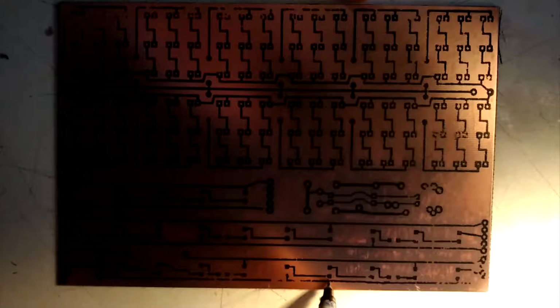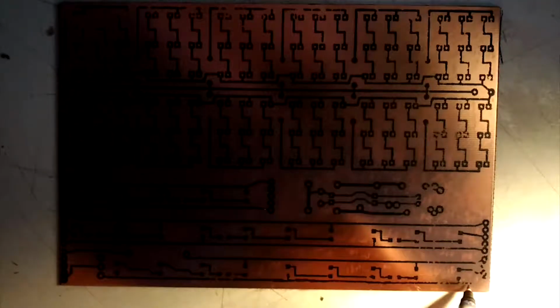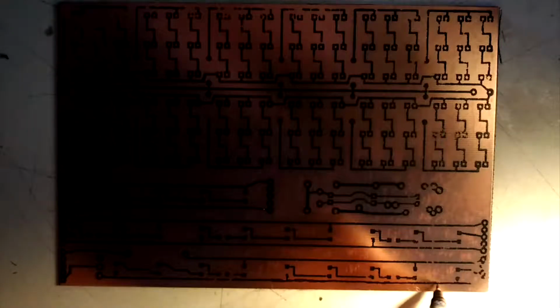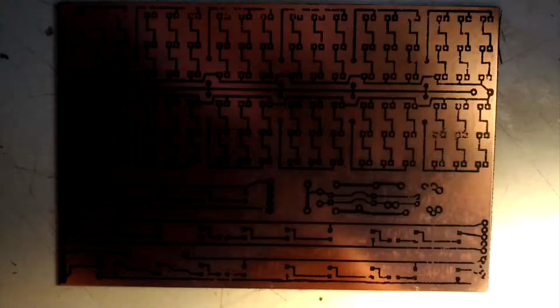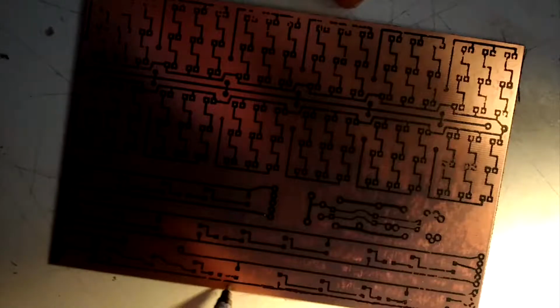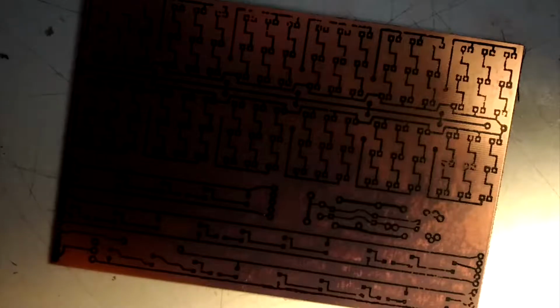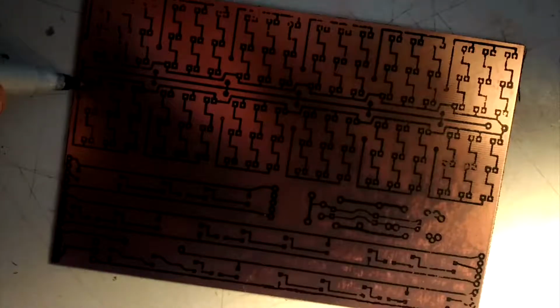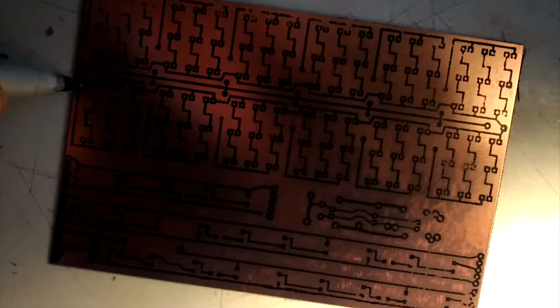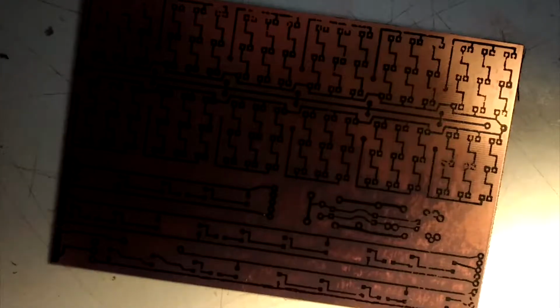When it comes out as well as it has, then I'm just not really up to redoing the entire board by sanding it down and such. There's quite a lot of work to do that. And toner, where it does stick, tends to stick fairly well, so it takes a little muscle to get all the toner off, just to put a new layer of toner with all your traces on. So I'm just gonna keep doing this until I'm done.